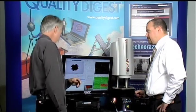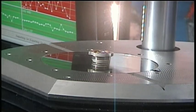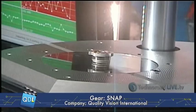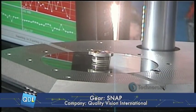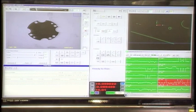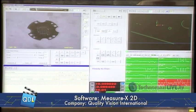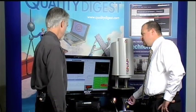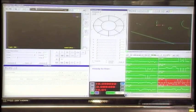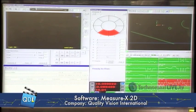The part on there looks to be about half an inch — 13 millimeters — and that entire part will be in focus from top to bottom. Looking at the lighting options: we have a backlight, very much like a comparator, and we also have direct surface illumination which lets us see down inside the part. There's another set of lighting that will really make internal features pop — the ring light.